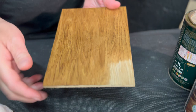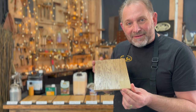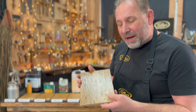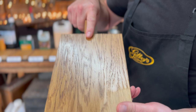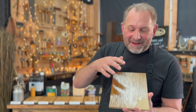Look at that now as an antique finish — two coats of hard wax oil and a wax polish. The Antique Gold has an oaky colour to it which has highlighted the grain a little bit more. You could use the Pure Gold or the Rose Gold. The Pure Gold has no colour in it, but the Antique Gold gives it a soft antique look. Two coats of hard wax oil with Antique Gold wax polish, and look at the difference. Unlike French polish, this is going to be hard wearing — it makes antique, old, or reclaimed furniture really usable and utilitarian.